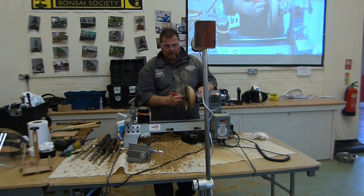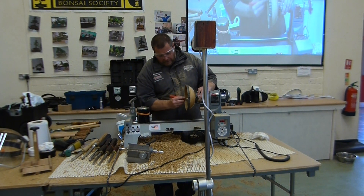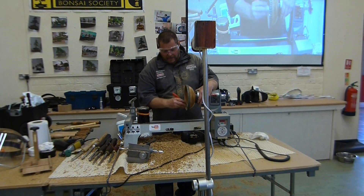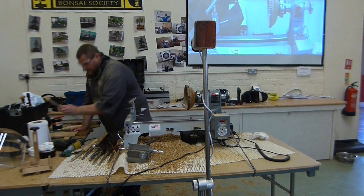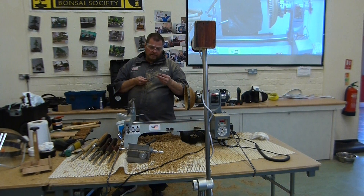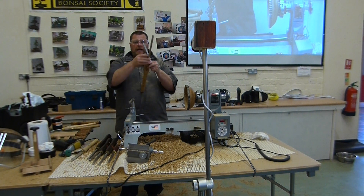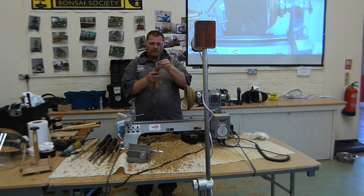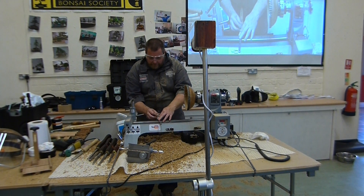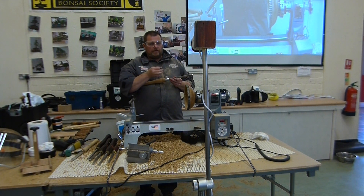Chris, can I ask, why do the finishing cut chisels work better than your carbide disc? Well, it's the release. I have actually got here — which one is it? I think it's this one. It's got a special angle, been designed — a specific angle for finishing cuts. The fine finishing tools act like a finishing scraper. I like the way that because it's around three quarters of a barrel, I can roll it over.